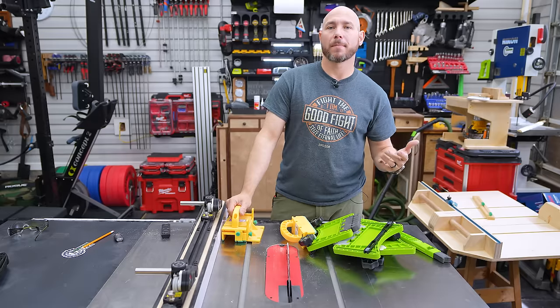As far as making your own push sticks, you can come up with any design you want. There's this tail design that's pretty popular and works well — I've even gotten into the blade a little bit with this one but it keeps your hands pretty good away from the blade. I also like this one from a friend at All Red Woodworks — it's his design, and basically it keeps your hand way up and away from the blade, especially when you're cutting thinner wood.